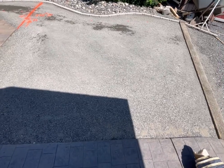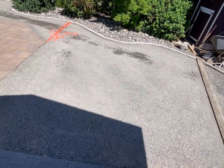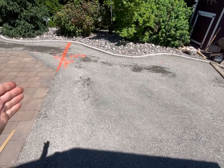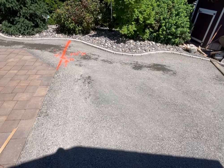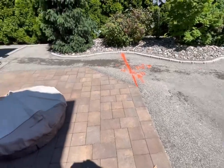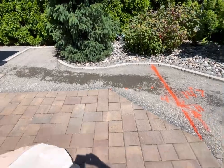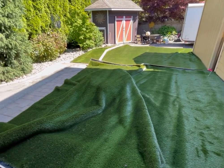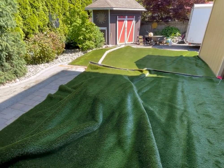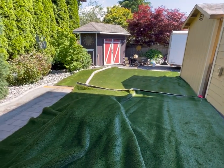We're going to roll the turf out away from the house so that we're not looking at the down side of the fibers - that way it won't look so shiny. You can see where I've marked the 14-foot, 7-inch mark, just a little extra, because the rolls are 15 feet wide. We'll roll one out there and then roll the shorter length one here and cut. I got curious and wanted to see that the turf was rolled properly as far as orientation goes - and it turned out that they didn't. The far end one was rolled backwards.